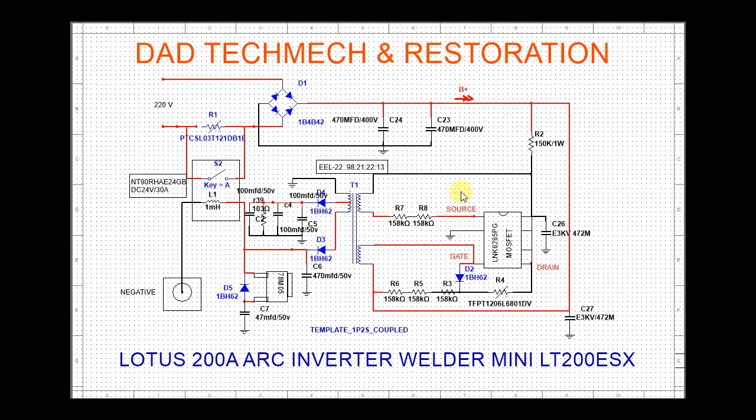We'll look at where the supply comes from — from the diode — and what the function of this PTC is. PTC stands for Positive Temperature Coefficient thermistor. Let's start here at 220V. This diagram will show us where the current flows. I'll show you how the chopper is activated, how the MOSFET is supplied, and how the relay is triggered.